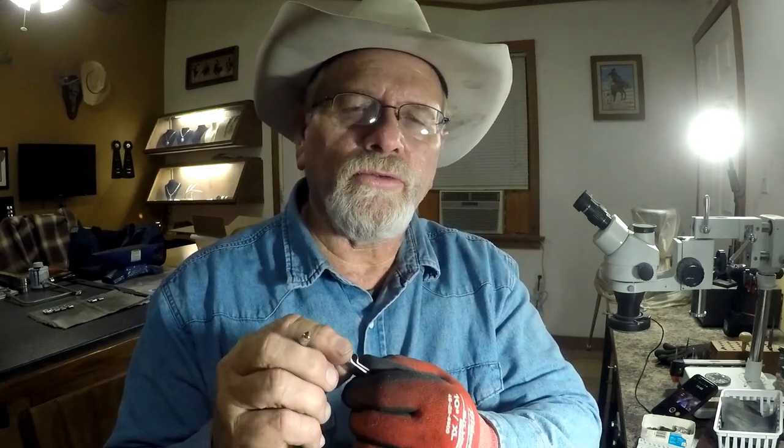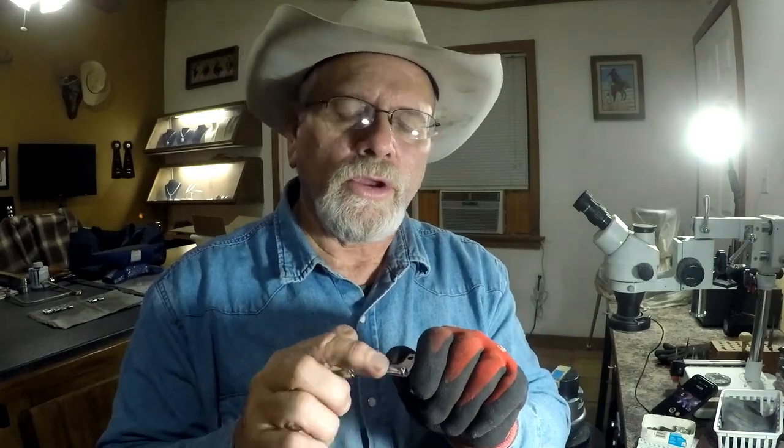Okay, what I wanted to say, this is just if you're going to have some polished spurs. If you are going to have brown or blued spurs, I wouldn't go to the trouble of highly polishing these swingers, of course. I would leave them kind of a rough finish, but I would still curve the ends of the fold on my spurs, so it just makes a better looking swinger. But these spurs are going to be highly polished, so I went ahead and polished the swingers too.